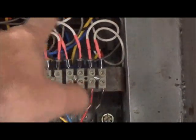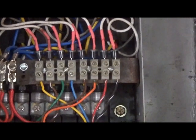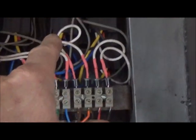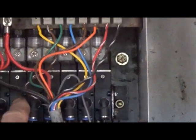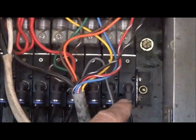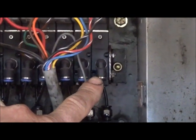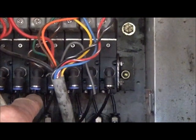After the diode, I run it into a relay. I've got eight relays — four here and four down below, hidden by wires. The reason is this box up top is rated for 30 amps. I'm not sure exactly what these draw — I think it's around 20 — but I didn't want to take a chance, so I put a relay on each one. Power comes through, operates whichever relay it needs to, then power comes from the relay down to the solenoid-operated air control valves. There are eight of them — two per control valve, one function each. There's a manifold back here with eight ports providing air to each solenoid, and each line runs to the air operators on the control valves that are numbered.